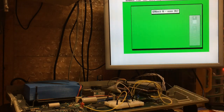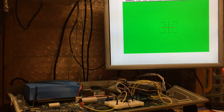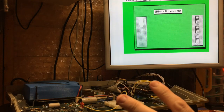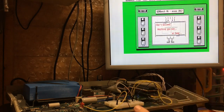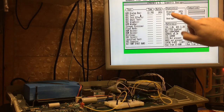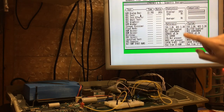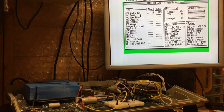That's still not bad because it's 16 megahertz. But obviously with the Blitter on, we'd expect to get slightly over 100%. The reason why I say slightly over 100%, again, there's no fast working RAM. This is purely just cutting the processor into high-speed mode when it can, and most of this work is being done from ROM and ST RAM, which is not accelerated, and you get a pretty paltry 102%. The integer division is pretty good.